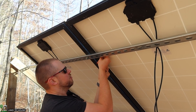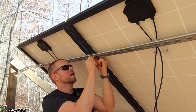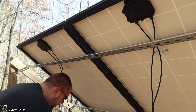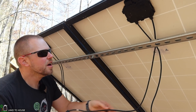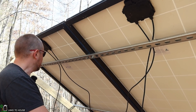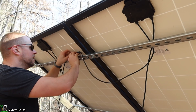When I put the unistrut on here, I measured out 39 inches, and that seems to have worked out well because that's how far apart the mounting holes are. The last thing I want to do is find my red wire — the positive — and connect it to this panel's positive. Then the negative goes over to the next panel and hooks up to the positive there, and finally this last negative goes to the negative of my power shed. That should be all we need to get this thing back up and running.